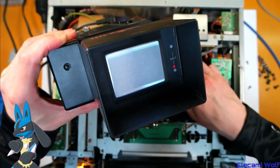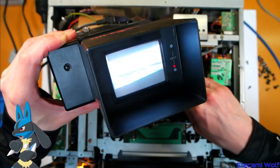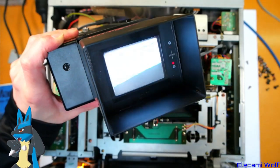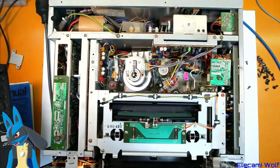Presumably it's because capacitors have leaked, the values have drifted, so timing is not what it used to be. Which would suggest replacing all the capacitors would bring it back to life. But I'm not going to do that because I don't have weeks to organise and replace hundreds of capacitors.